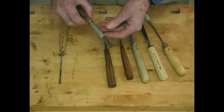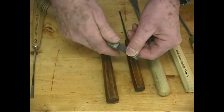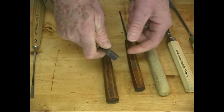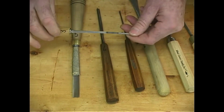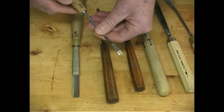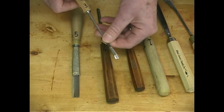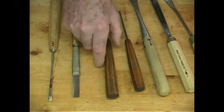In this case, I have taken cord and wrapped it around the tool. It's nice for, I can hold it and do close work on whittling or any hand work. You can also actually modify the tool itself. And here I've heated it and put a little back bend in it so that I can use it more comfortably upside down. So don't be afraid to change. Consider your tools simply as a work in progress, and they can be modified for your particular needs.